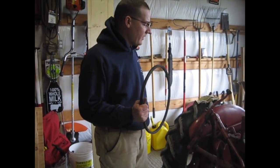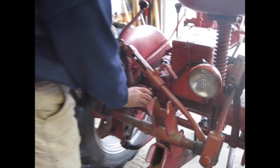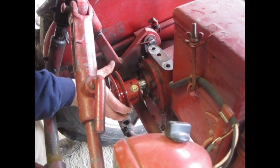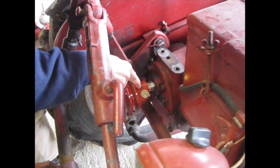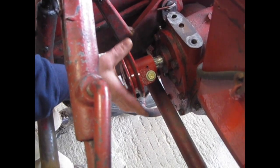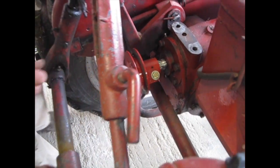I'm going to go ahead and hang my belt on my rear pulley here. It's important to know that these pulleys are extremely expensive. So make sure that if you have one, your bolt is tightened down and through the hole you have a snug fitting roll pin so there's no play on this. What happened to my last one was there was a little bit of play and it wore out the spline so I had to buy a new one.